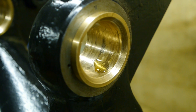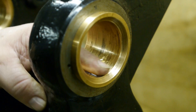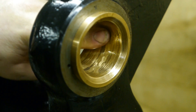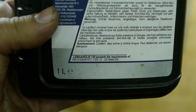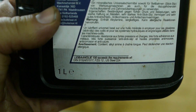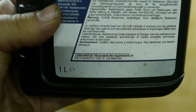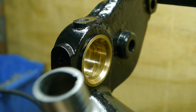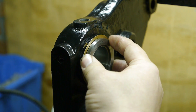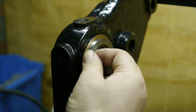A bit of oil — I'm using a way oil that I got with my cheap Chinese lathe. It's pretty thick, but I have no idea if it is the correct oil for this. I should Google these numbers — maybe somebody knows if this is good oil for plain bearings. I'm gonna put in this part first — it's the inner part of the bearing. It feels nice.